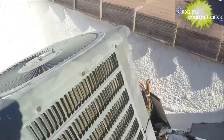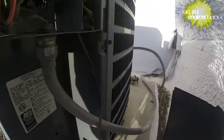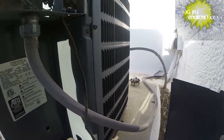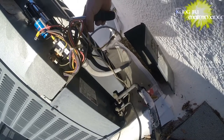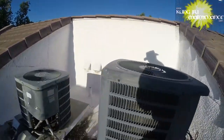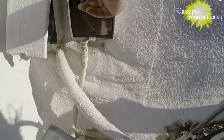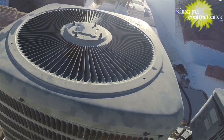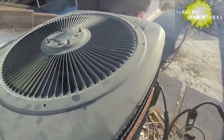I'm going to re-discharge the capacitor again. We're going to take our yellow start wire back off and let this fan run a little bit longer. Position it somewhere a little safer — that holds it out there. We need to let it run a little bit longer. We're going to adjust the fan and hopefully we haven't lost our compressor. So we're going to shed heat. What time is it — 6:20. I'll give it five minutes. Cool, and we'll jump back in at 6:25.